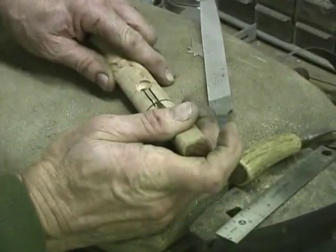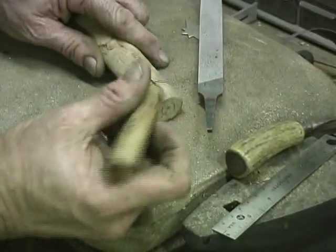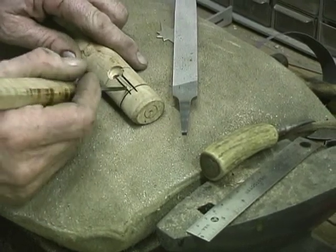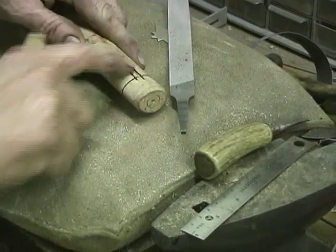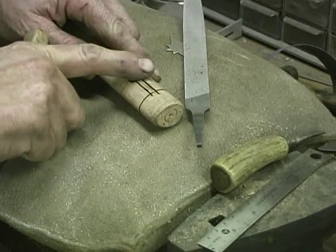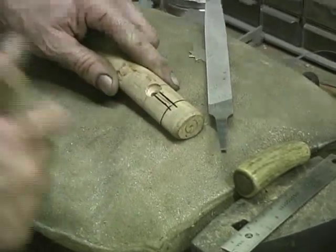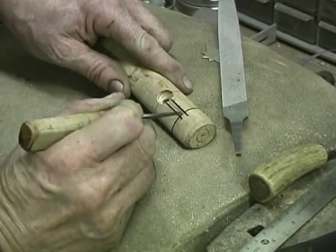I will use a Dremel tool to take that out, because I can take a Dremel tool and just take the center out. And you've got to be careful prying this over. You don't want to bevel this edge, because if you do, your pewter will follow it, and you won't have a good, clean, crisp edge. But we're going to go back to the grinder.